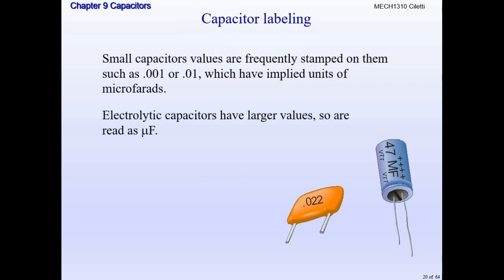So most of the capacitors actually have the size stamped on them, all right? Remember I talked about the voltage rating being on there, too. So that blue one would have a voltage rating, too. But the blue one says 47 microfarads, okay? Most of them have 0.001, 0.01. When you see those and they don't have anything else on them, we always assume them to be in microfarads, okay? The electrolytic capacitors, also microfarads,